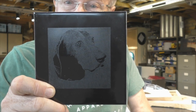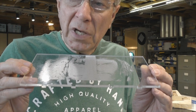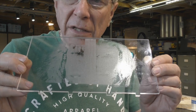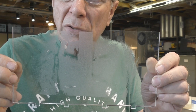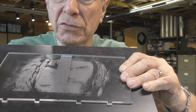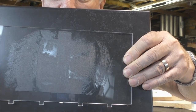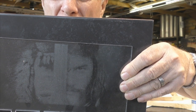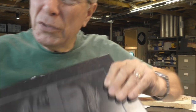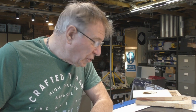Here I've got a black glazed ceramic tile. If you catch it in the light just right, there's a picture there, but when you look at it straight on with no light it's pretty useless — only two colors exist: what the laser produces on that material, and the background color. The same problem exists for acrylic: only the background color and whatever color the acrylic lasers to. That color doesn't look clear until you put it on a black background and catch the light just right. So you've got to choose your material carefully.